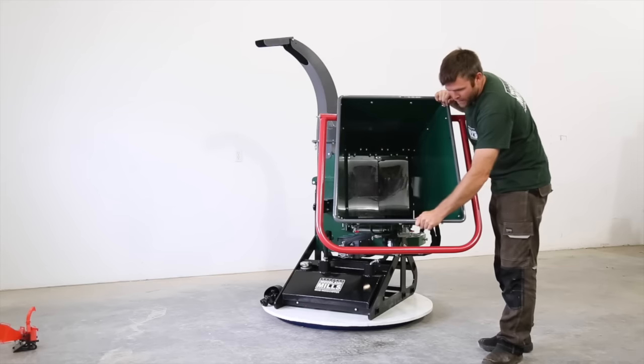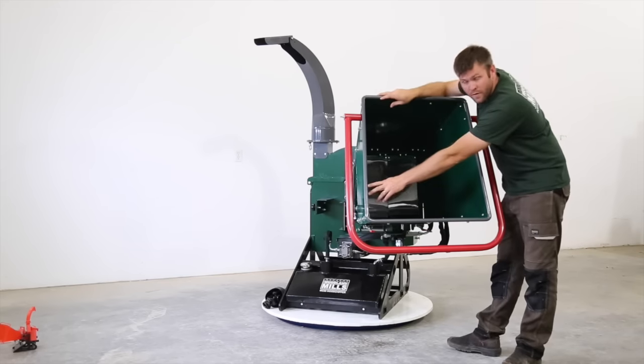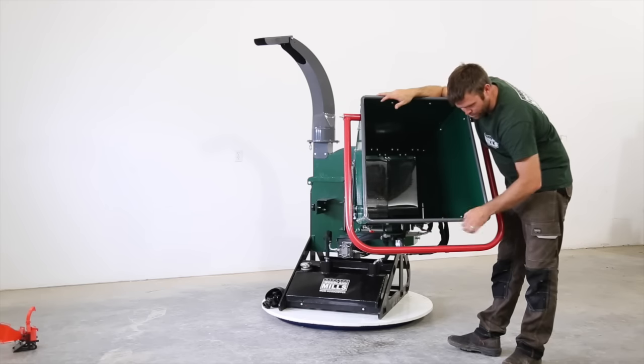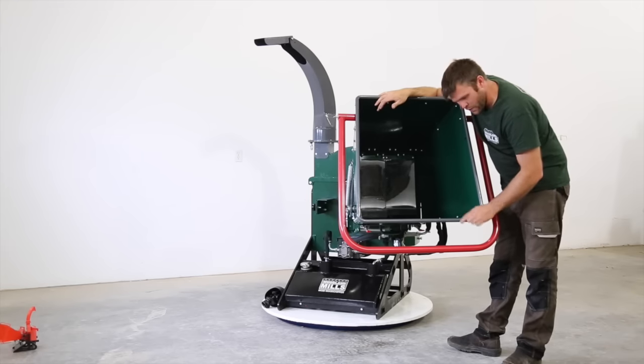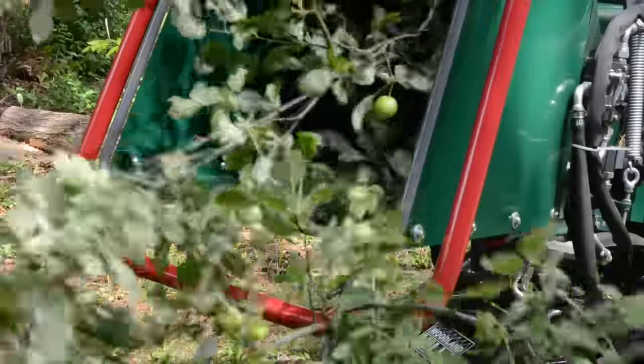This outer rim here is basically designed to get rid of the sharp edge of the metal of the chute. And what this allows is, as your limbs are coming, the sharp edge of the metal can bind into the limbs, and the weight of the log and the limb will give you hangups. With this bar here and the radius, it forces stuff to not be able to get caught up, and it hops up over.